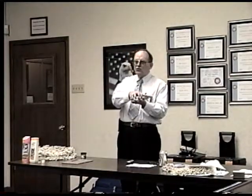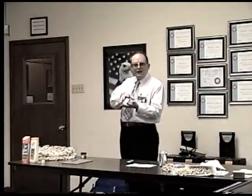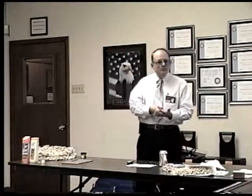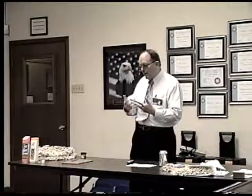Every now and then you'll see where some carpet cleaner has taken, like our product safety solvent — a dry bottle of solvent, pretty potent stuff — and just poured it onto the carpet because it's really greasy. He blots it and walks away, and you can see it swell up. The only way of curing that is to get it dried out well and, with a hypodermic needle, get some glue down in there and put a weight on it to re-glue it into place. So you yourselves can do that.